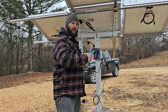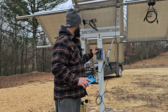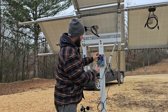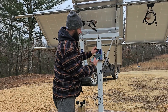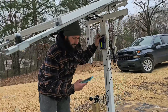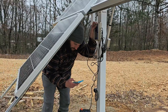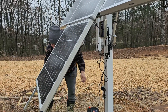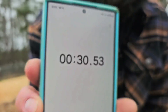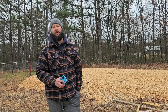How long does it take to move from fully west to fully east? I've got my stopwatch ready. It's fully west — we're going to hit the timer at the same time as I hit this button. Now we're going to go all the way to the east and see how long it takes. We've got 23, 24, 25, 26 — 30 seconds. It takes 30 seconds. So 30.5 seconds — we'll program it for 31 seconds.